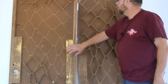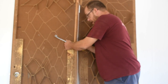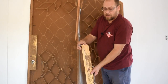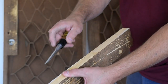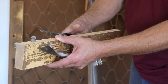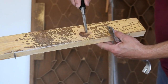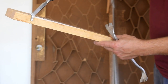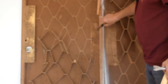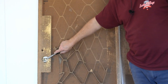There's not a whole lot to these, that's why you have to be really careful whenever you're cutting these doors. You can see they've got a solid piece — I'm not sure how solid — but they've got a little bit of a solid piece here, like a one-by, maybe a one-by-three. They had it put together with this little piece here, and then this was glued to the back side of the door, and the same thing here glued to the front side. These pieces are for the doorknob to set in.